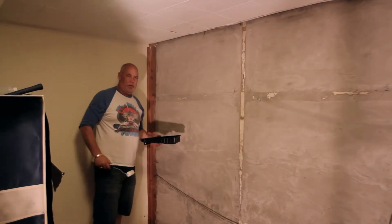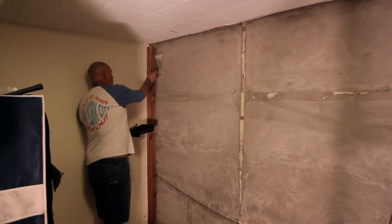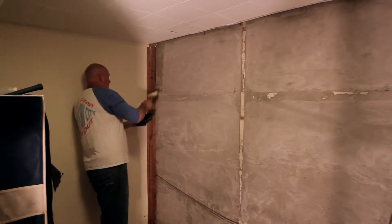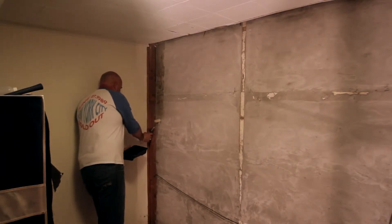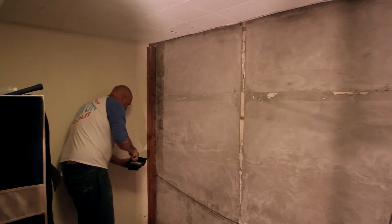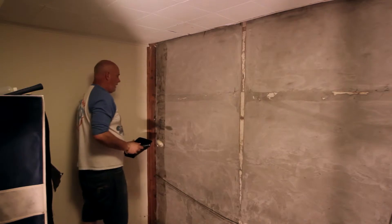I've marked my wall off here. I'm using six inch strips and I've put some primer into this roller pan. The trick is you simply need to get complete coverage on the wall where the strip's going to go. Take a pencil and mark down that six inch strip — I go about seven inches to give a little overspray, it won't hurt a thing. When this is done we usually go over and put some UGL water-based foundation paint on this so you won't even notice the strips exist. You just have to make sure you go a little wider than your actual strip.